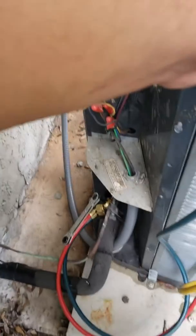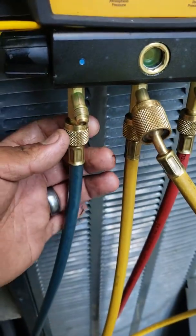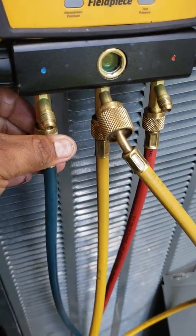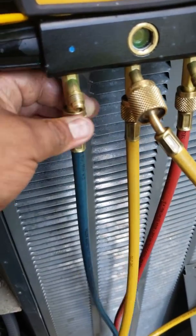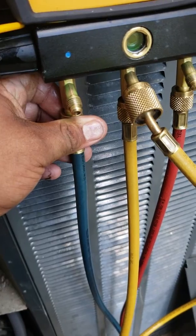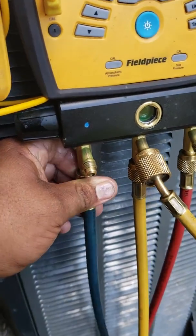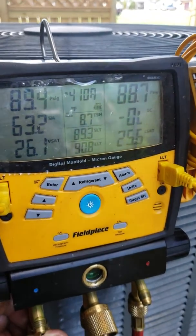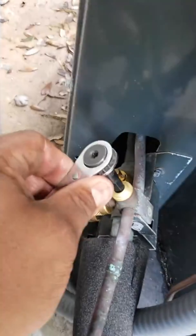Which in this case it was, so what we're going to do is open up the high side king valve. But before you do that, we're going to open up the suction side and let all the nitrogen out. Now you're going to purge the nitrogen out until you have about 20 psi. I took some out already just by doing that and it's dropping down to 80. So we're going to do that until it drops down to about 20 or 30, then I'm going to open up that king valve — make sure you're ready.